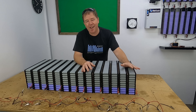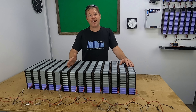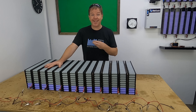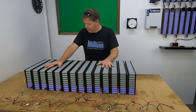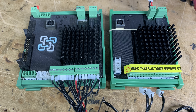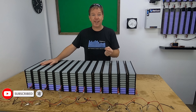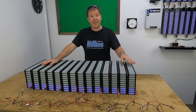With the 14th battery complete, this finishes the 14S 193P battery, making almost 2,800 18650 cells recovered exclusively from old laptops. In the next episode, I'll be removing the 10 kilowatt hour battery I've had in service for the past four years and replacing it with this one. In the final episode, I'll be installing the battery management system, cable management, and doing a couple of load tests — so stay tuned. If you haven't already, please hit that subscribe button and the bell notification so you get notified when my next videos are released. Thank you very much for tuning in — this has been an enjoyable one, and I'll see you on the next one.